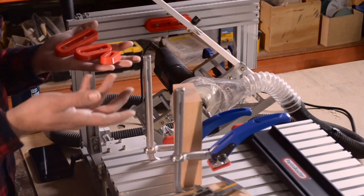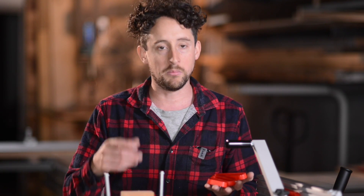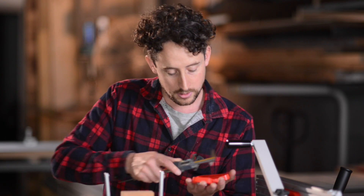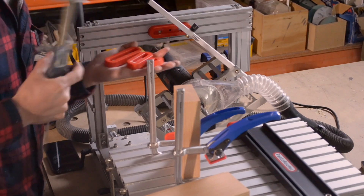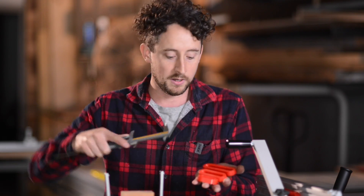My piece of stock is 75mm wide, so I want to make sure I get a tenon that fits comfortably within that — that's the width of the tenon. The templates have numbers written on them in Imperial. The middle B template is about 60 millimeters long, giving a 30mm wide tenon. The large one is about 85 millimeters long, giving a 42.5 millimeter tenon — because it's half, you get the idea.